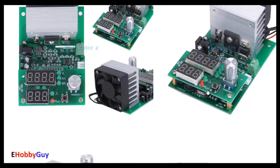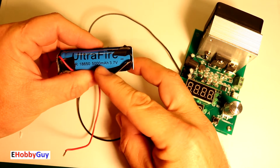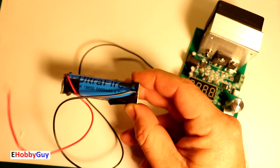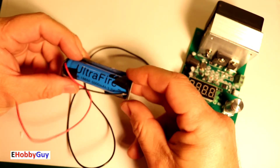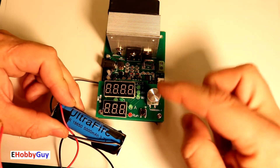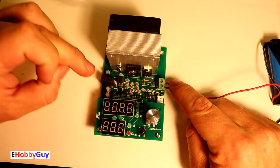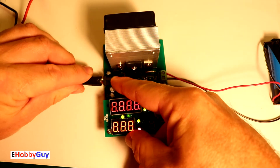Here I have a fully charged cheap Chinese 18650 lithium-ion battery claiming 5000 milliamp hours, and a cheap makeshift battery holder I made. I did get some proper plastic ones in the mail, but I had this ready — it's fully charged. I'm just going to wire it into the two terminals. The recommended input voltage for this device is 11 to 14 volts, and here I have 12 volts providing power.